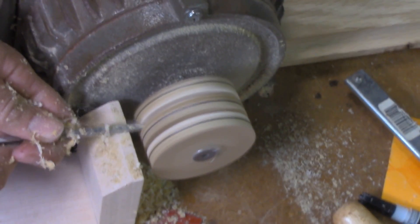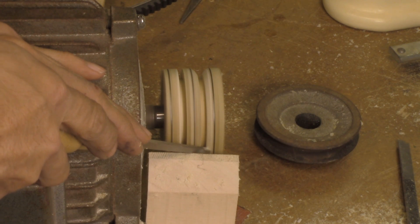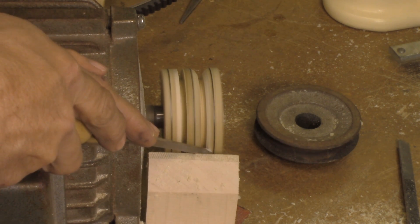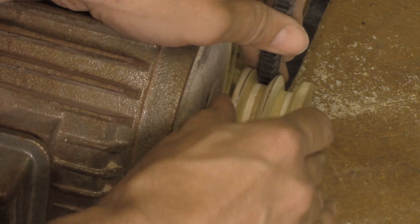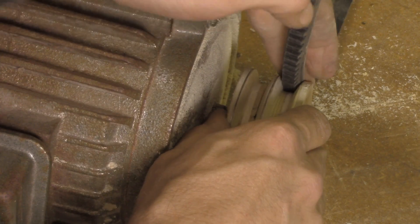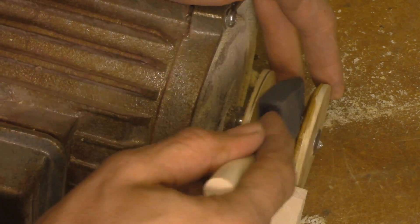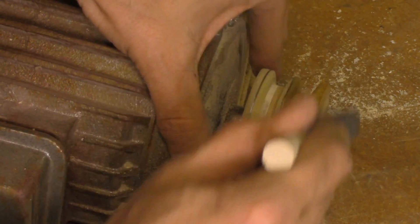You're going to turn the pulley in two stages. The first stage is getting the central internal diameter correct — really easy with a narrow bench chisel and a set of calipers. Just turn down until you've got the right diameter and you're done. Then you need to slope the sides, and this is the really important part, because a V-belt transmits all of its force by the sides of the belt touching the sides of the pulley. It shouldn't bottom out in the middle, and the center of the belt shouldn't touch the pulley anywhere. All the action is on those sloped sides, so you need to get them correct. To make that easier, I grab a V-belt, turn it inside out, and use that to check the fit as I go — turn a little, jam the belt in, check the fit, turn a little more, check the fit. Once I'm happy with the shape and fit, I put on a couple relatively heavy coats of wipe-on polyurethane to stabilize the wood, soak into the end grain, and make the pulley stand up to wear better. You can also paint them if you want — it doesn't make a lot of difference.